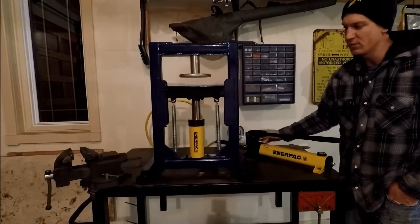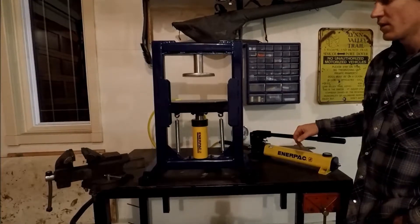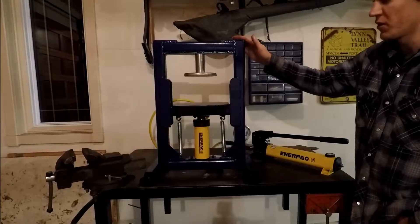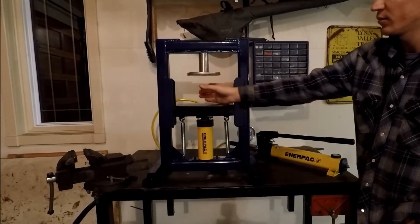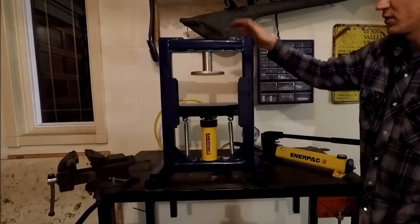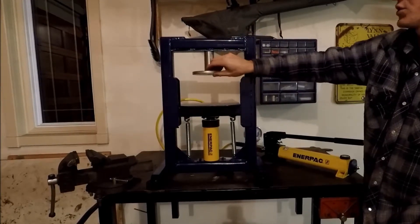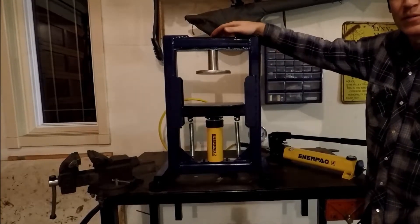And it's just a little touch with the hand and it's coming back down. For those of you that watched the previous video on drilling stainless steel, here's what that piece was right here. This can be set up in here and act as the pressing unit — it's nice and rigid. Everything here is just made out of mild steel, 2x2 by ¼ inch.